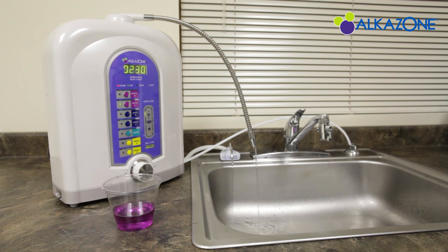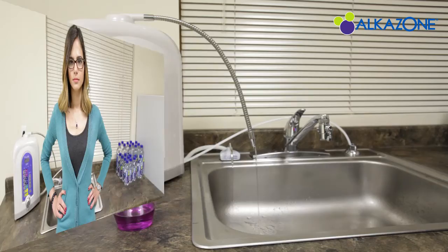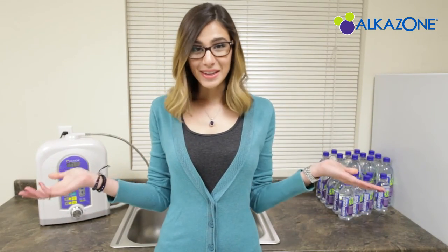If the color is quite different, that means that your water source is different. Check the included pH chart to see what pH the machine is producing from your exact water source. You can raise or lower the pH value to compensate for the difference. And that's it, you're finished.